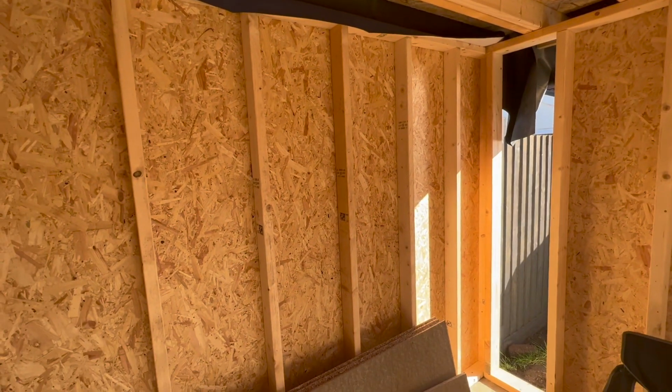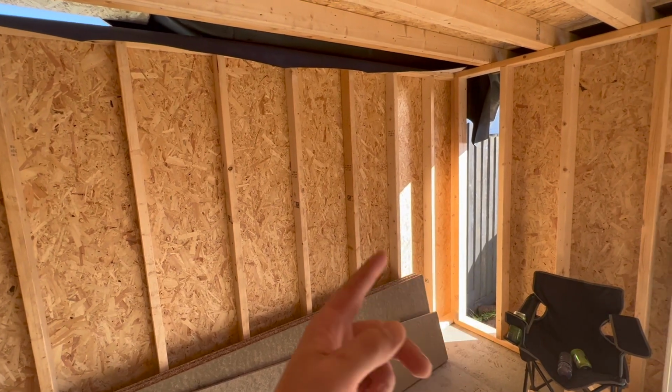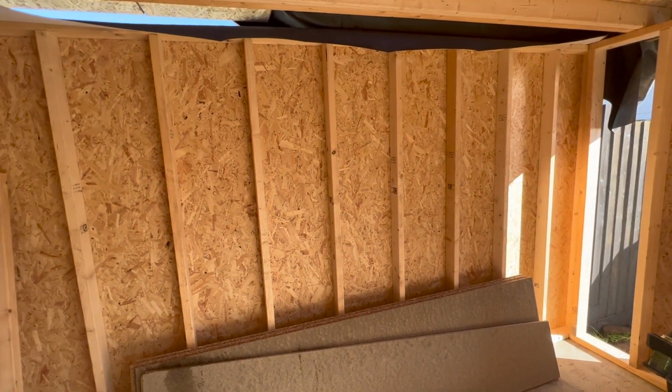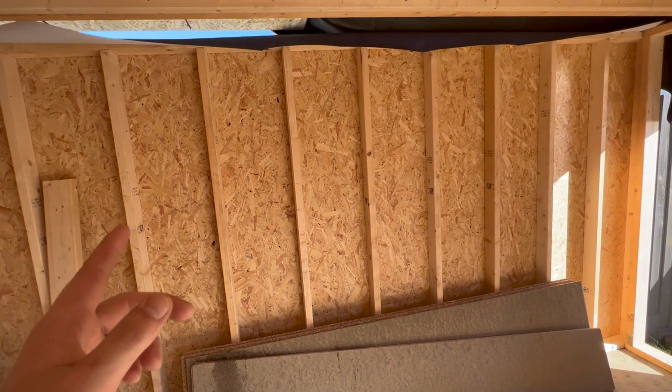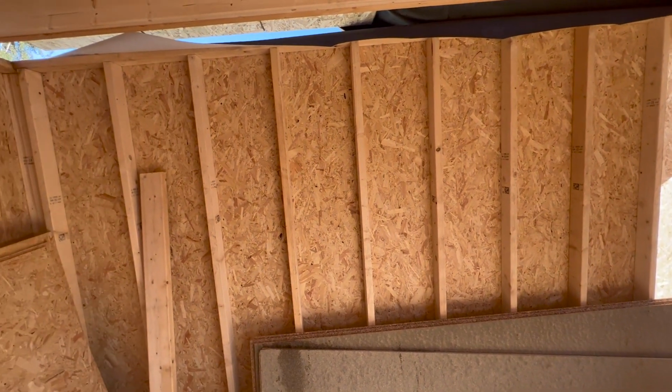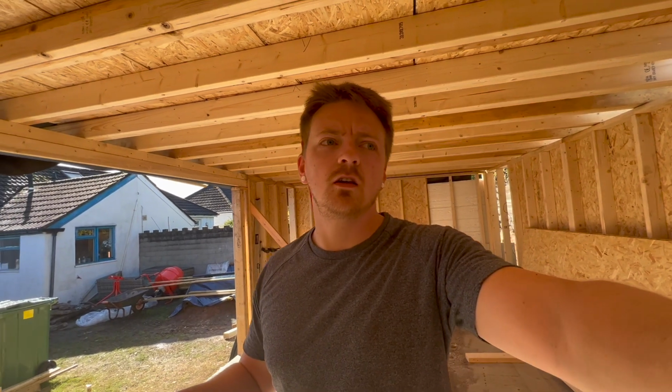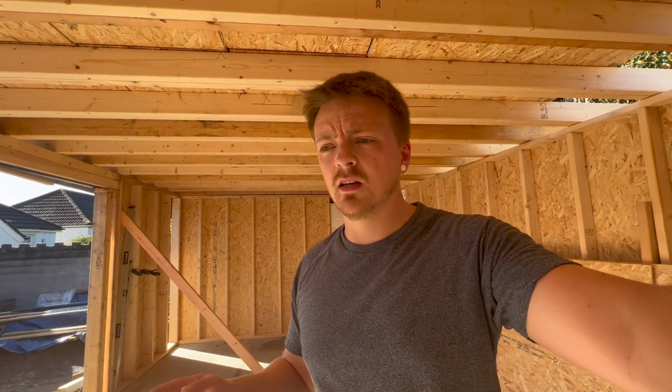get the timber cladding, slide the wall out the front, lean it up against the shed. It's already battened, I got the battens on there, get it cladded and painted with the fire rated paint. He'd say one base layer of intumescent paint, and then another layer of the intumescent, and then a top layer of fire retardant. So I've seen videos on it, it's amazing. The paint sort of bubbles up and creates an insulated layer against flames.